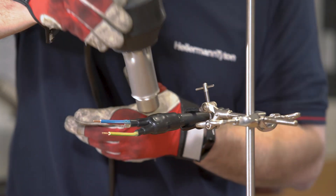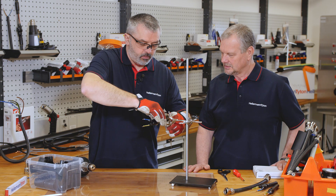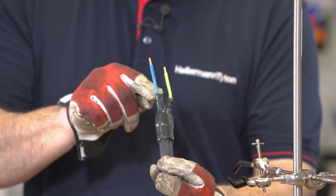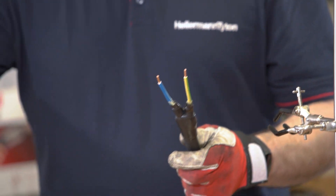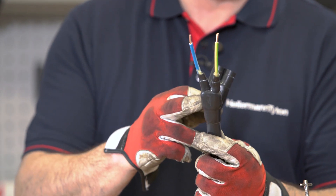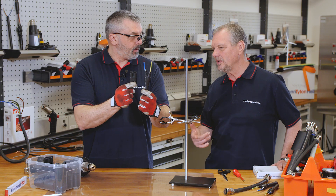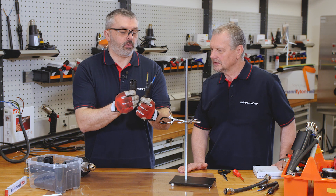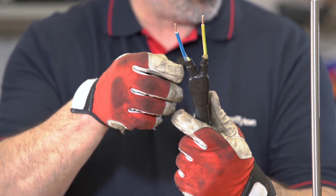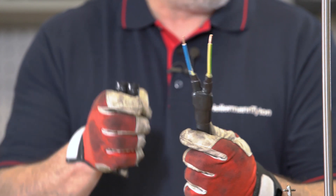You can see that's recovered nicely now — it's changed totally from what you put on there. Let me explain the memory and the recovery. This is our finished part: a recovered shape, adhesive either end, sealed well so no moisture or dirt can get in. That adhesive at the end adds a layer of protection. This is how we supply them at the factory — this would be the supplied profile and this is the recovered profile, so you can see the difference in the memory process. The memory means it's been molded and then expanded, so it provides a perfect seal to the cable once installed. It allows you to install the boot over smaller cable sizes, and when you recover it, it shrinks to your recovered cable diameter, giving you a perfect seal.